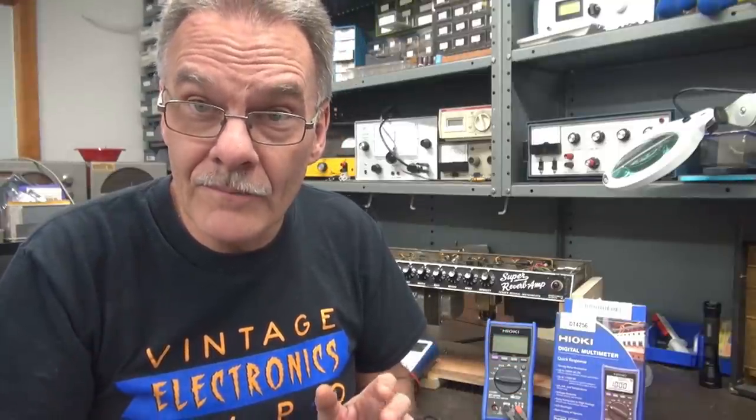So in part two, we're going to go in now and change the caps on the eyelet board. We're going to repair the tremolo circuit, because he said that's out too, right? Then we'll put in the stock tubes and give her another shot. But I've got another little surprise for you in this video.